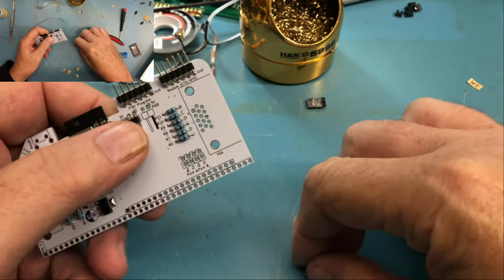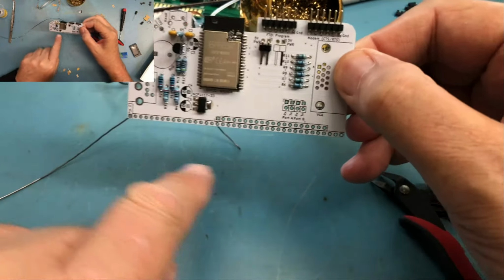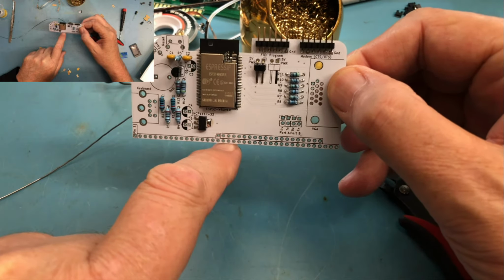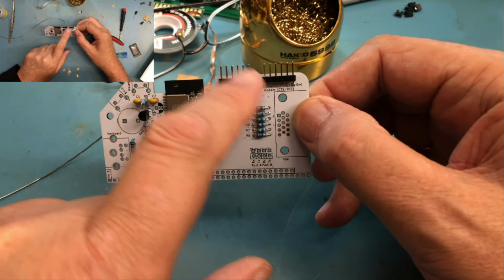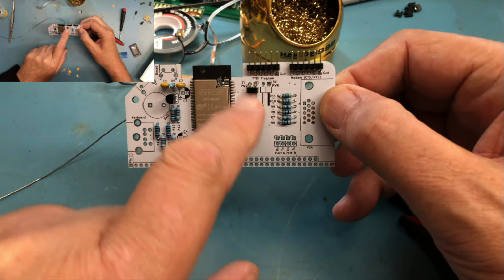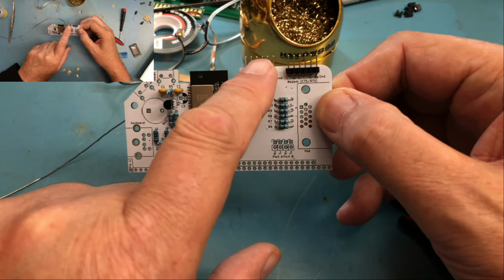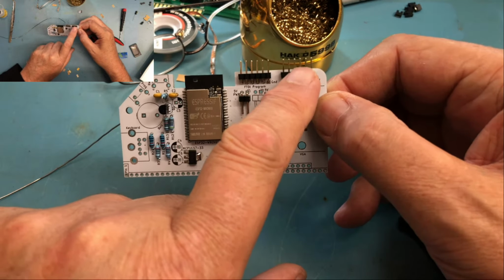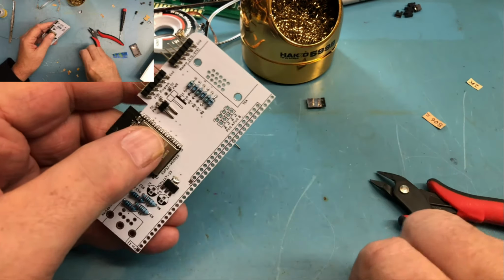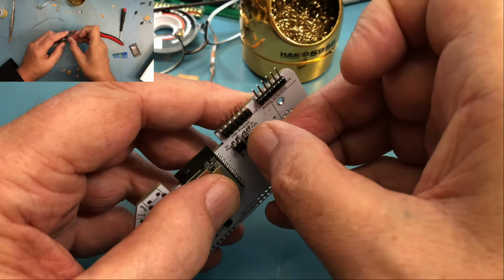And these go in this position here. And what these are used for, so normally in the RC2014, you're going to pick up power off the RC2014 bus down here onto the board. But the FTDI cable can also provide power to the board. And so with this jumper here, if I had the link over the top of it, I could power the board off the plus 5 here from the FTDI connector. I can do the same thing with the modem connector with this second one over here. Also note that that modem connector isn't an FTDI connector. I think the pinout is a little bit different.